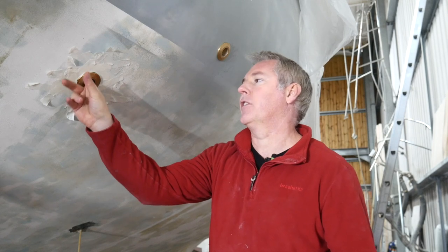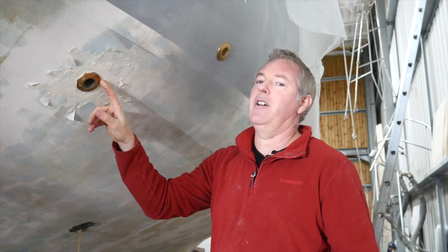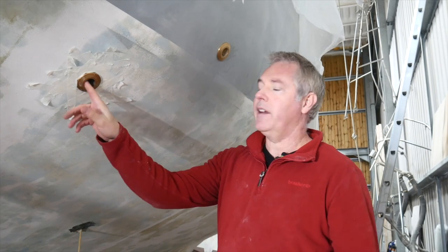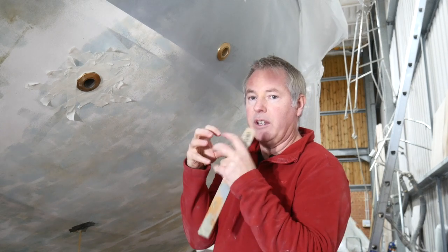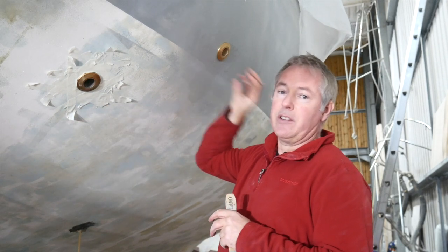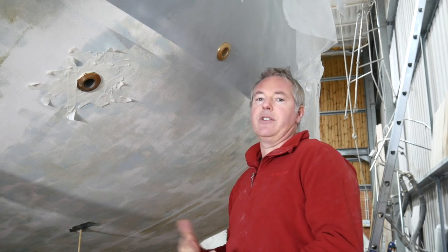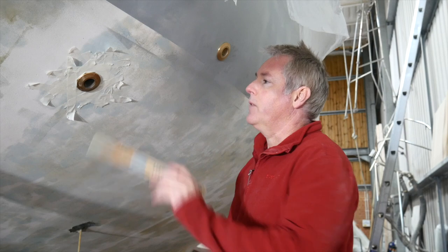I've lined it up, and I think what I need to do next is go in and re-drill those holes for the studs. This is really embarrassing — I've got to cut out this perfectly good through-hole, because it's the one that's actually locked on tight to the backing plate due to resin leaking and making an absolutely solid connection. There are two ways to do this and neither seems good: one way you're guaranteed alignment but risk the epoxy sticking; the other way uses the tube to align the backing plate but the flange might not be perfectly aligned. The biggest problem is there's just no room for error — the tolerances are so fine everything has to be perfect, and that's really hard to achieve. I'm going to experiment with different ways to find an improved method.